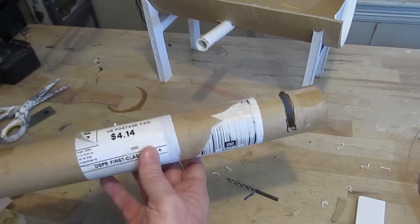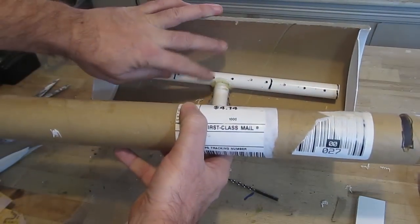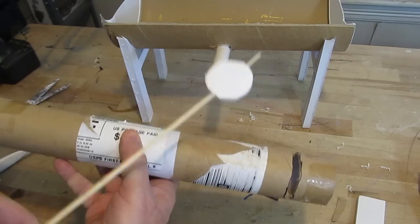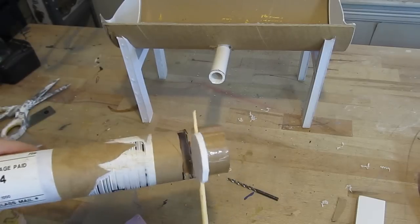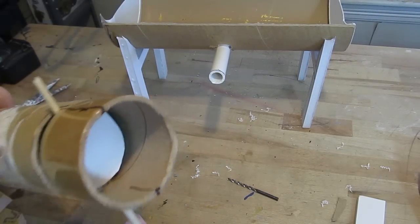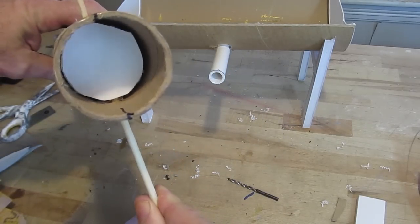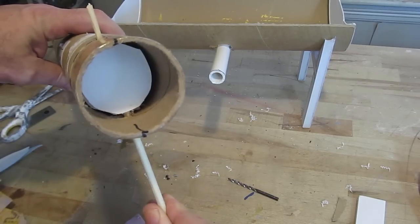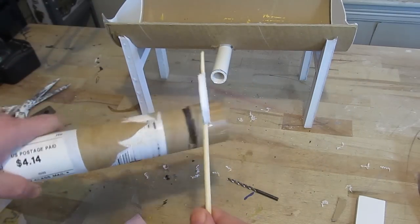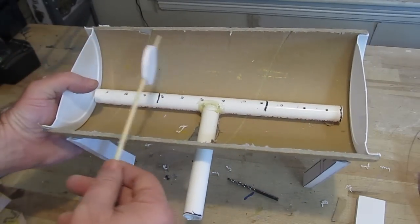And this is how they work. In that tuyere, I cut two slots. Picture that large tube as the tuyere — I cut two slots in the right positions and then made this with a steel rod and a round-cut piece of steel, so you can open and close it. See how that will open and close now? Simple as that. Then close up those slots by welding something over them, or you can weld a small piece so you can still rotate the rod, then put the slots facing down in the forge and that will be quite okay. One paddle there and one paddle there.